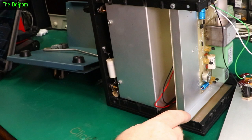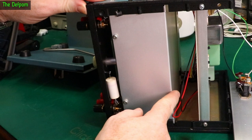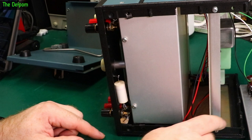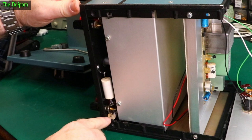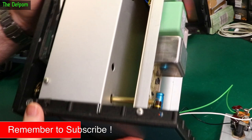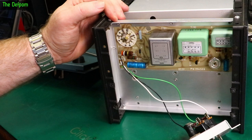This gives a better look at the inside. We've got another assembly here, and there's a big capacitor — a big film cap going between the casing and the guard terminal. That's obviously for the guard terminal. There's also another big cap going from the guard terminal somewhere else — it might be going to the input or the common; it's hard to tell. I'm sure it's on the circuit diagrams anyway.